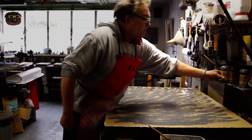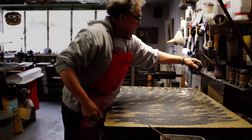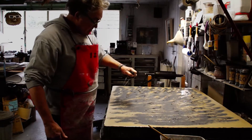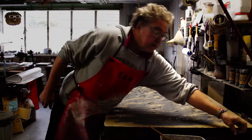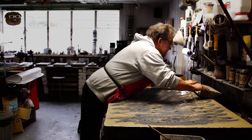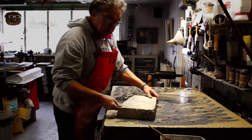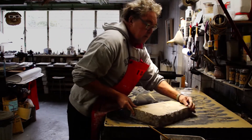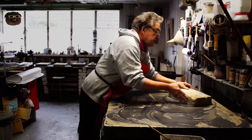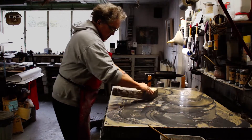Then we're going to continue with a sponge with water. I take a sponge and just sprinkle a certain amount of water on the abrasive, like that. Now you will see — I have to get my hand stone, so I'm already reaching like this. Then the first thing before you start graining is to turn the hand stone around over the surface, just to mix the water with the abrasive.